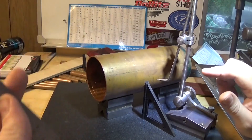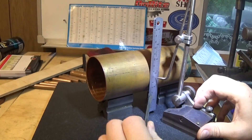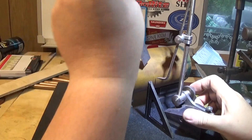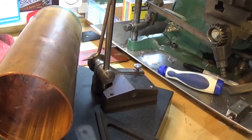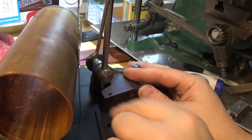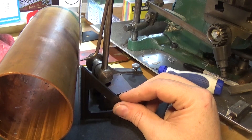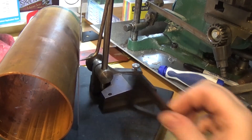Probably the best way to do this is just to get a ruler and push that up against it with the scribing block and check it with the square. I've had a bit of a fiddle around with the adjustment here. It's really not a fun little setup but try and move everything around so that you can actually see it. If we sit this here like such and put one of the stands with a little square in there — that's really not too shabby. So we're going to call that the center on top of those V-blocks. That's the easiest way to do that.